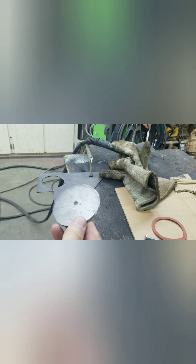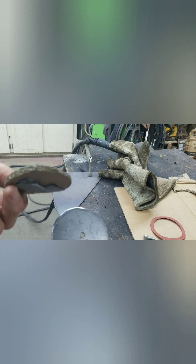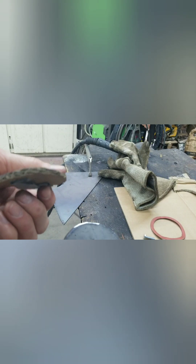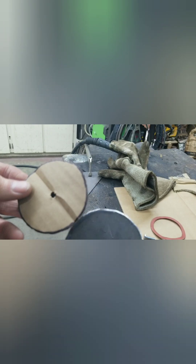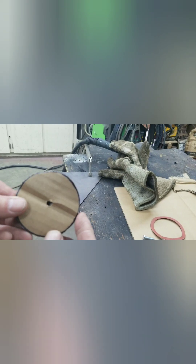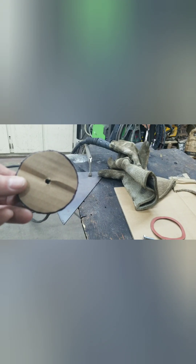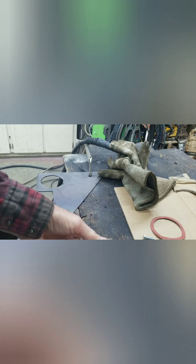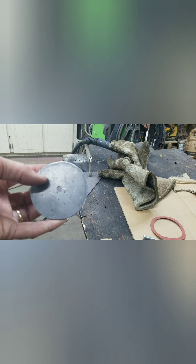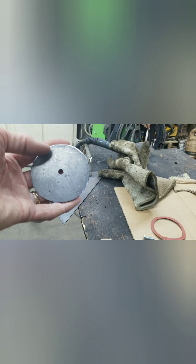It just took me 30 seconds with a grinder to clean it up. The cardboard isn't even singed because the tip never comes close to it — it just rides along the edge, and the cutting is all about an eighth of an inch out. You basically make your template and then shrink it by the width of the tip for an inside cut, or enlarge it by the width of the cut for an outside cut. Anyway, I hope that helps somebody — it's a very quick way to make anything you need with a template and cut it exactly with the plasma cutter. If this helps you out, please like the video and subscribe. Thanks.